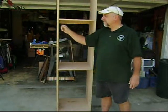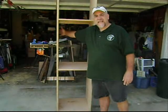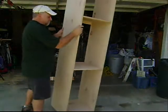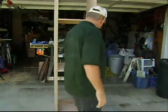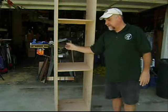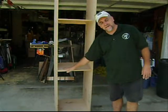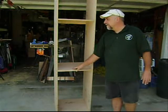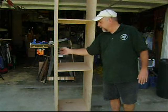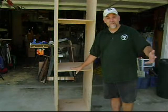Now let's get to making the second half. First thing I've got to do is trim up the sides. I've got a bunch of sheets of plywood that my boys and I have taken to my table saw and cut down to 18 inches wide on each side. Now I need to cut them to length to seven feet tall, and then I need to make some shelves. Basically, I take the same boards from the plywood and just trim them down to 18, so I've got square 18 by 18 shelves, plus little support pieces for the bottom. Then it's a quick assembly. I've drilled holes to make for adjustable shelves — I'll show you how I do that and how I set the depth and lay them out.